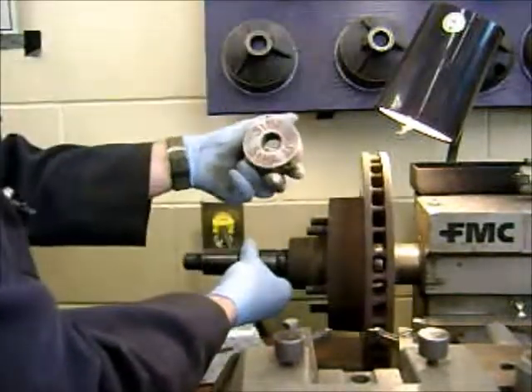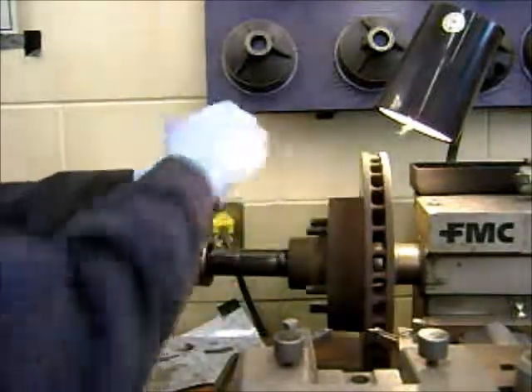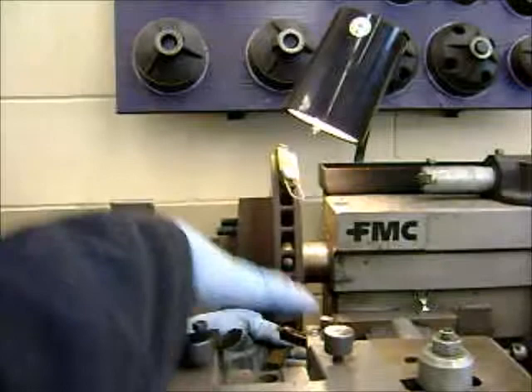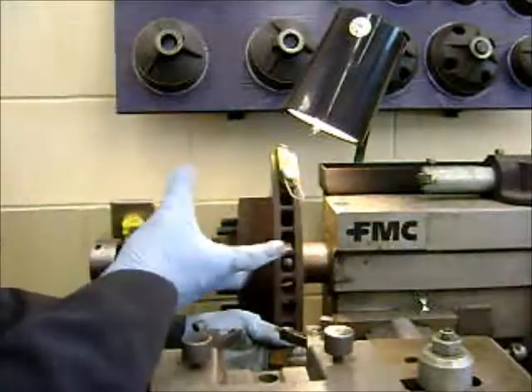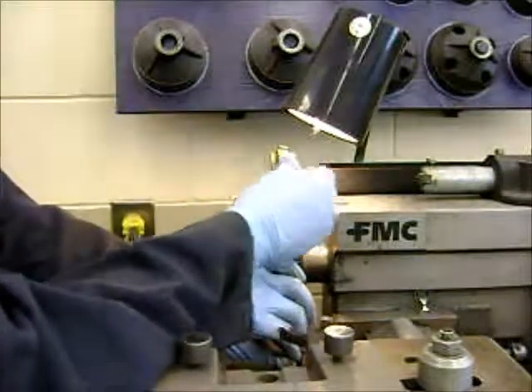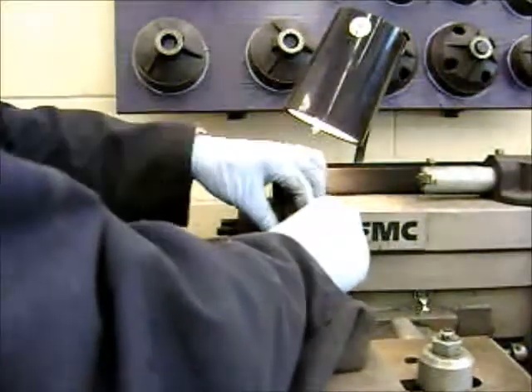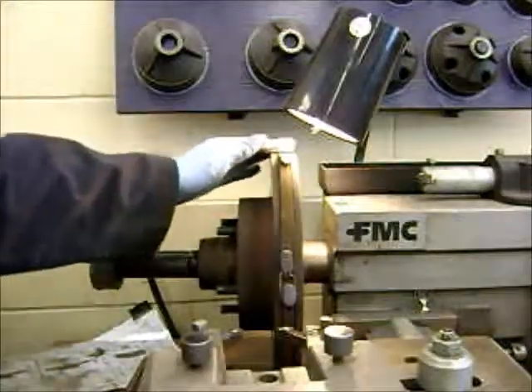Put the crazy nut with this side out — and this backwards thread looks like this — just give it a snug. When we cut this, there might be some vibration which will cause chatter and give you a really crappy finish, so we've got this rubber band with lead weights on it, which we just hook together through the center, and that absorbs any vibrations.